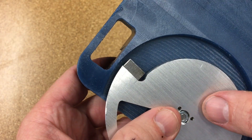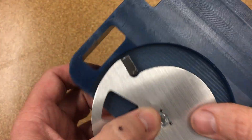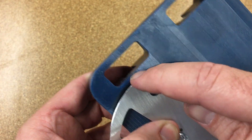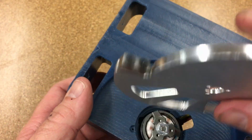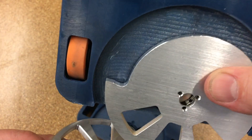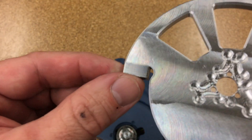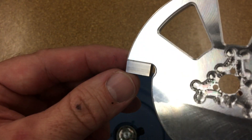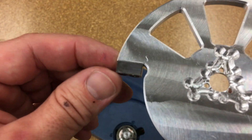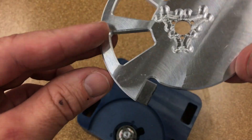I'm doing two things to address this problem. This is a new chassis I machined and a new weapon disc. First, I've made more clearance here — more room between the tooth and that pocket. Second, while the original weapon disc was just a solid piece of aluminum, this new one is still aluminum but the tooth itself is made from tool steel. It's an insert that's screwed in, and I think the tool steel will be much less likely to get deformed and catch on that pocket the way the aluminum tooth did.